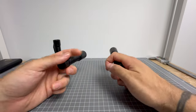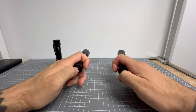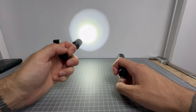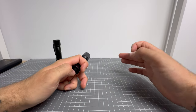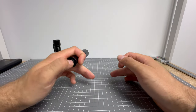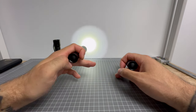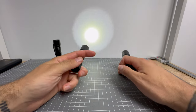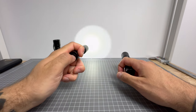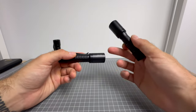Now let's look at the beams. The way these lights work is on time advancement. It depends on how long the light is on whether it'll advance or not. If you leave the light on for less than 150 milliseconds, the next mode will have advanced. The time the light is left off makes no difference whatsoever. So you can't just click off and on to go to the next mode. The mode advancement relies on how long the light's on, not off. It's the same with these two.